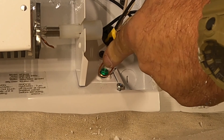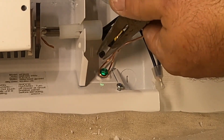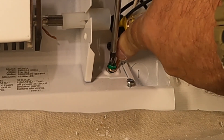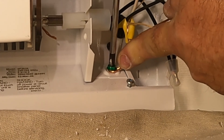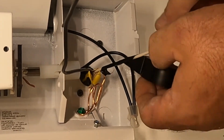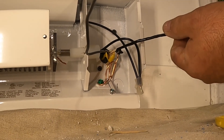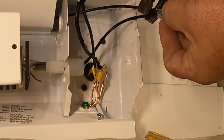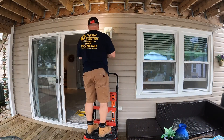The equipment grounding conductor is very important — I believe you're not really an electrician until you know how to ground. Bonding the metal frame of this heater is critical. What I do is wrap the wire clockwise around the grounding connector and then use needle nose pliers to squeeze the conductor and make a nice solid bond so all the metal on the appliance is electrically grounded. Then you need to identify your conductors — I mark the hot conductor with black vinyl tape. It's 120 volts and 120 volts combined to make a 240 volt connection.